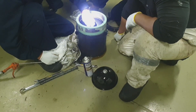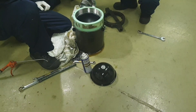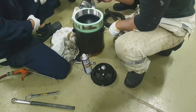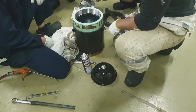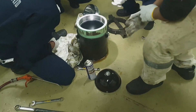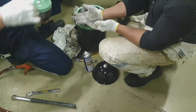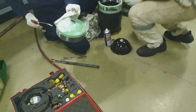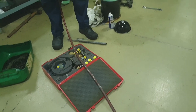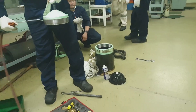Fit the lifting tool of the other half and mount the other half of the accumulator assembly. I didn't show the marking which we put before disassembling the other half of the accumulator. To clean properly, you must use compressed air for cleaning the accumulator before installing.